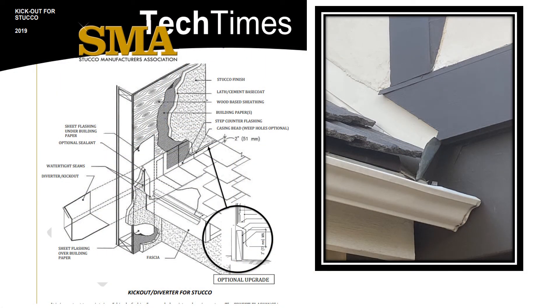The SMA and other industry groups provide specific details on how and why to install this type of flashing. The principle is really quite simple. We know that most rainwater hits the stucco wall and is deflected down. However, the industry acknowledges that incidental or small amounts of water may find their way behind the stucco membrane — this must be accounted for.